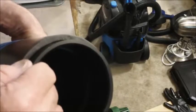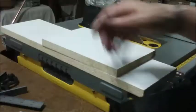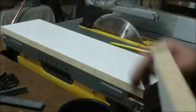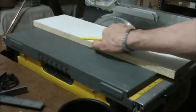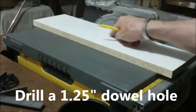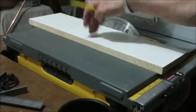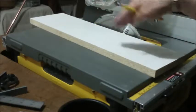That's going to be a little tricky. But what I'm going to do is build a stop that will be able to support those pieces, because the other problem is when you put the piece inside here, you want it to be level so that this piece will just fit right on top of it. So I'm going to cut two four inch square pieces out of this piece of melamine, and then using this piece as a jig base, I'll just set it next to the saw, measure in two inches, and drill that hole. Then I'll attach the dowel to the piece that's going to be cut, stick the dowel down into this hole, and then just turn it — the table saw should cut a nice four inch circle out of that.